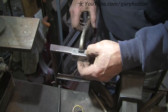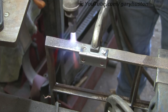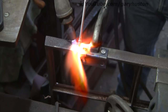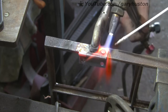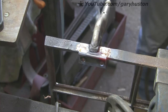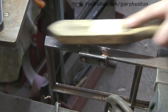That looks like it's tightened that screw up quite nicely - get some heat on it. Now what amazes me about this cast iron is it started to crack when I was welding, but I'm going to put a hell of a lot of heat in here and it probably won't do a thing. I don't quite understand it - it's a peculiar material, cast iron, really is. It's difficult to get the cast hot without burning the hinge, but I think we're managing. That'll do - I'll leave that at that. Clean that up once it's gone cold.